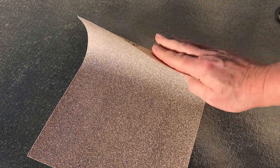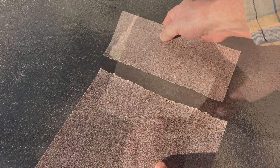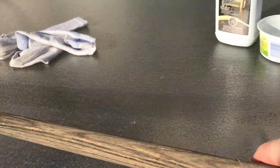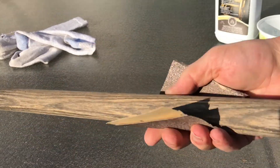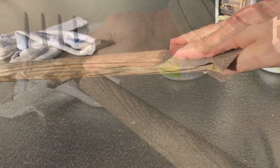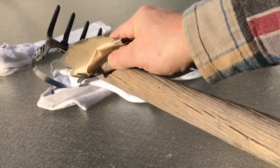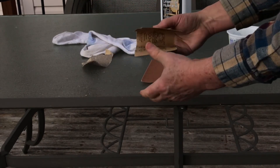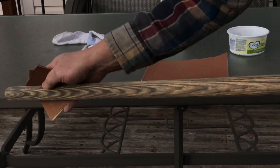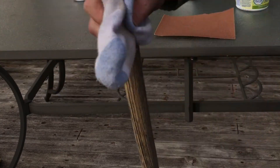Take the coarse sandpaper — here I'm using the 60 grit. You can tear off a piece by creasing it first and folding it back and forth a few times. Use this coarse one first and go over the entire surface. This will take off any caked-on dirt and remove the weathered skin of the wood. Keep doing this until you can start seeing the lighter wood showing through. It doesn't have to be perfect, but remove as much of the old surface as possible. Now that all the rough spots are gone, go over it a second time with 100 grit to make it a little smoother. Then wipe off and remove as much of the sawdust as possible using one of the socks.